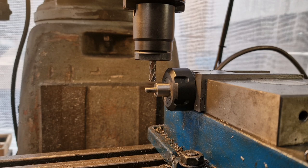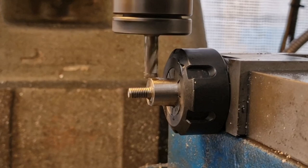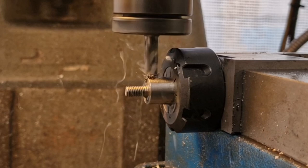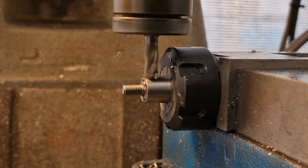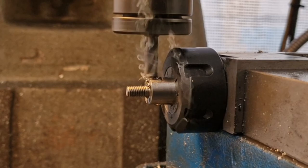Crack it on, let's see what's what. So if I've done my job properly, it should just do it, like, you know, like that. Nice and steady. Feels a bit tight. There you go. So, and now a slightly lighter cut. Another 16 thou or so. Like that.